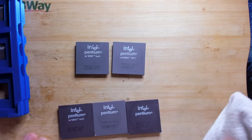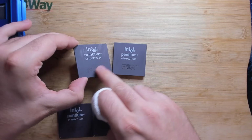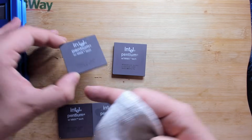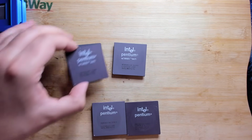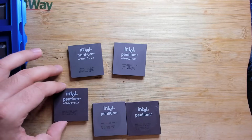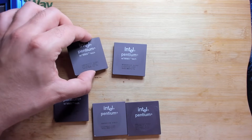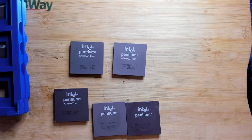As I said, Peter already made a video and he also scratched off the coating of these CPUs and then you could see what's underneath. This was most likely an Intel Pentium 166. I can't verify it. It could be a 200 version like this one here, but they were expensive. The 166 version was a lot cheaper, and if you relabel them, well, you can bag the difference between a 166 versus a 233 megahertz version, and this was your profit, and that is why people did it.